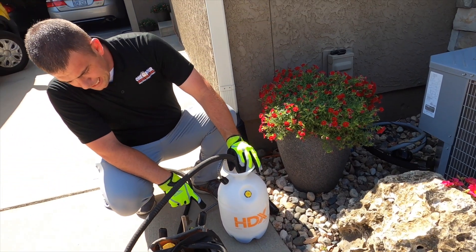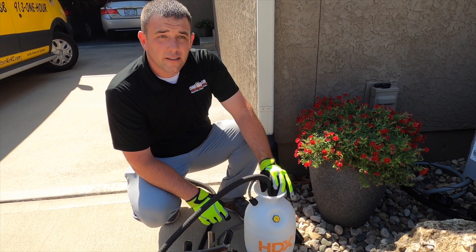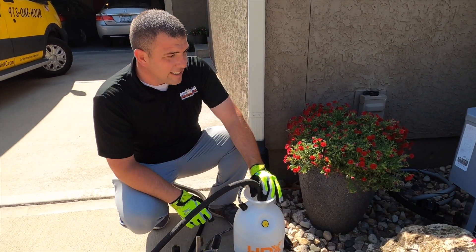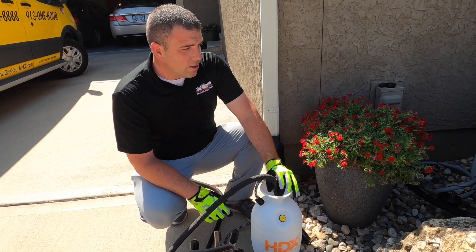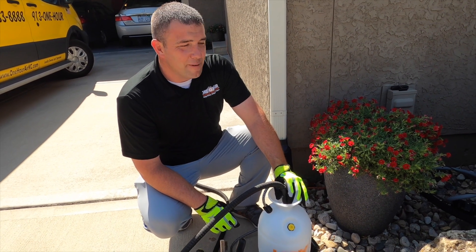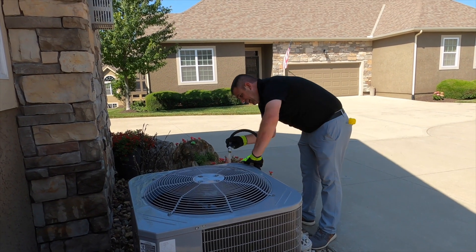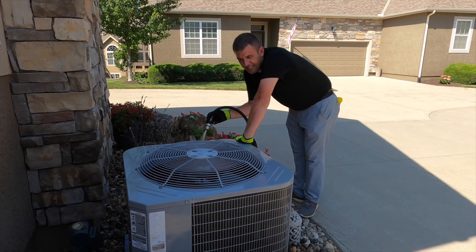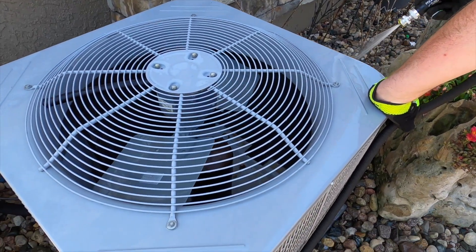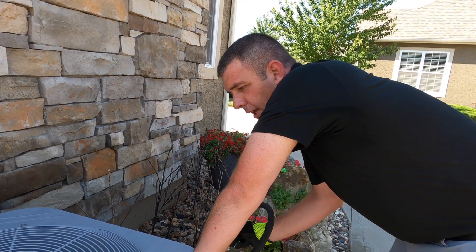That's my tank sprayer — it's got just a little bit of coil cleaner in the bottom. It doesn't take much. You want to dilute it so it's not too strong going on the equipment — mostly water, a little bit of coil cleaner. Like this one at a glance doesn't actually look that dirty, but once you soak it in coil cleaner and start running the water through it, that's when you see the chocolate milk rolling out of the bottom. It can be deceiving. I hit it with some coil cleaner and ran the hose over it — voila, it makes all the difference versus just washing it out with water.